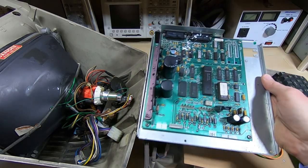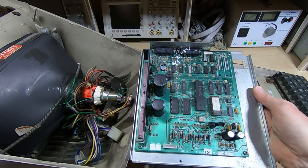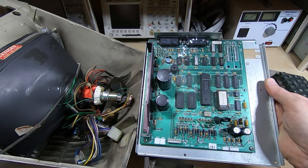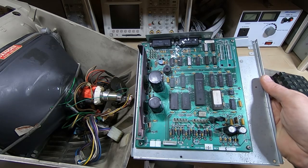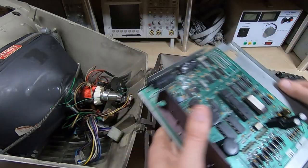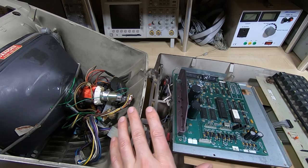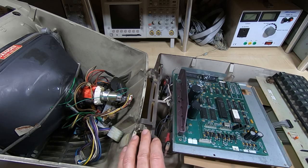This is quite an interesting modification — it's almost an aftermarket upgrade for the ADM3, although some were manufactured using this. It's functionally similar to the standard ADM3 dumb terminal, but where it differs is that it uses a large-scale integration device. This particular device is an NS405. If you're not familiar with the NS405, it contains most of the circuitry of the ADM3 mainboard all crammed into one device.